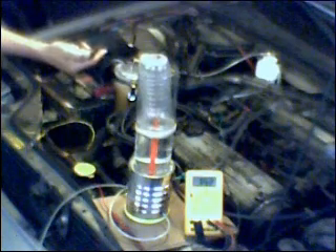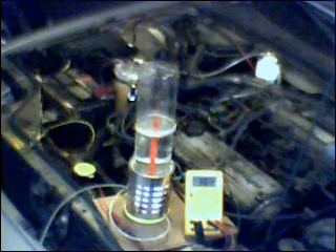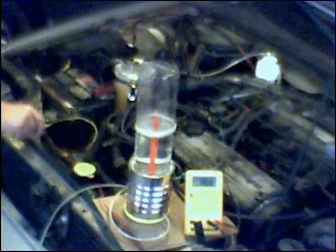About two-thirds full, and at 44 seconds — which is where we produced 500 milliliters last night — stop. A minute and 10 seconds, or 70 seconds: I produced 500 milliliters of gas at 9.75 amps instead of 15 amps. So that is about 66% as fast as it was last night. If I crunch those numbers, I think that will bear that out — that's a good finding. I'm going to turn the electrolyzer cell off.